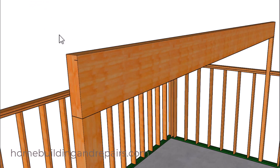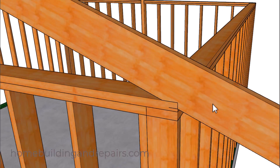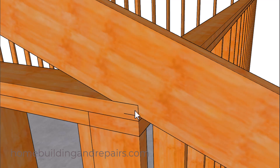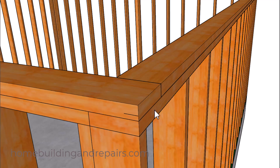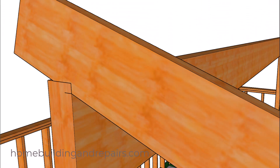So I'm going to go ahead and come down one inch at the top and at the bottom. You can actually change these measurements if you need to — I can come down an inch and a half here or three quarters of an inch up here, because again we're not dealing with a specific rafter pitch ratio. Let's take a look at what the rafter would look like after it's cut just to give you an idea, and then we'll do the same thing up here to provide you with a close-up.